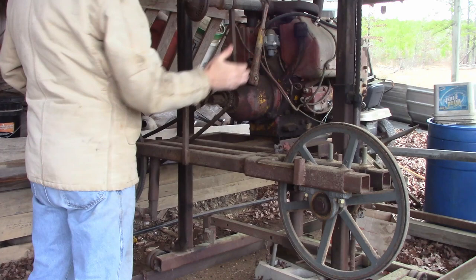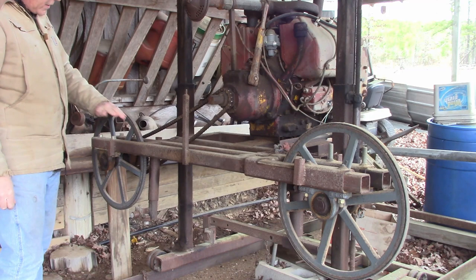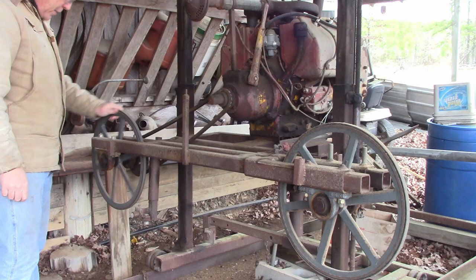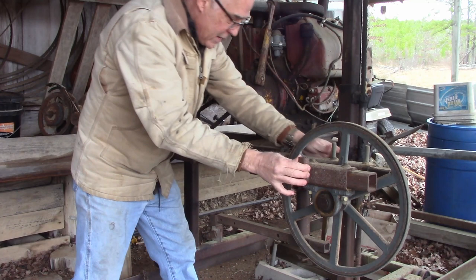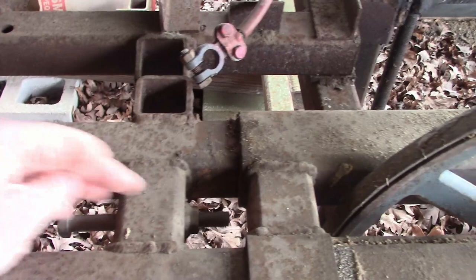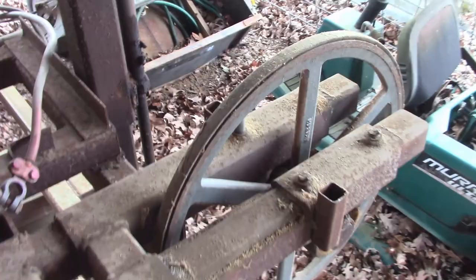This is a clutch right here so you engage and disengage the drive. It runs with a chain over to this side. I bought these wheels — they came with a V-belt on there as grip, running in these bearings. This side is fixed, this side is adjustable in and out with a bolt you can tighten. The adjustment is just a piece of pipe welded in here with a nut welded on this side — you adjust the bolt in and out and it pushes this side out. That's my tensioning system.